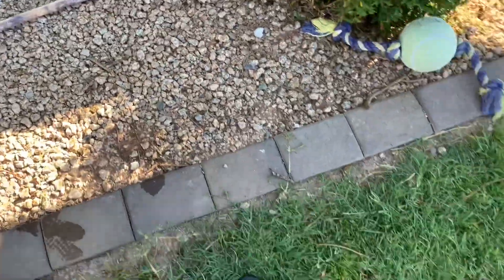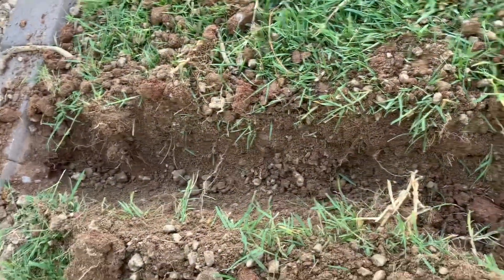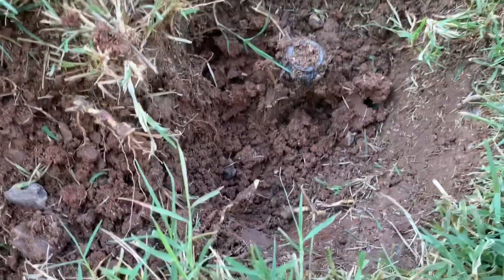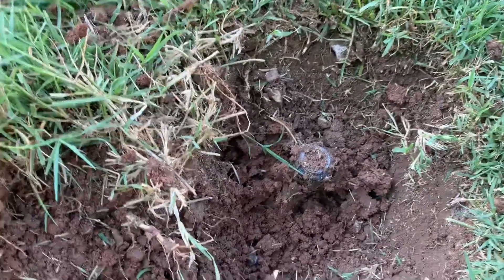I won't bore you with the details of digging. I'll turn this thing back on after I'm at least dug step by step. You can see I kind of got my trench dug here. Now I'm digging around this sprinkler head. Basically all you want to make sure is you get all the way down to the bottom so you can work with the existing pipe that's in there. So we found our depth here. I'm still going to have to go down a little bit further, but I finally hit that white pipe. This one's probably about a foot down — honestly, maybe a little less.